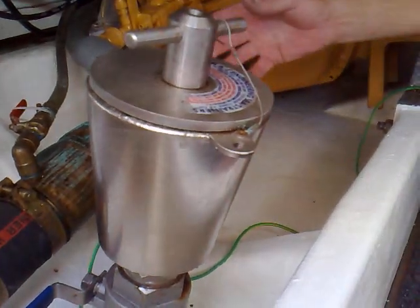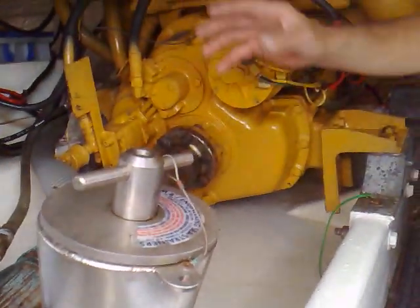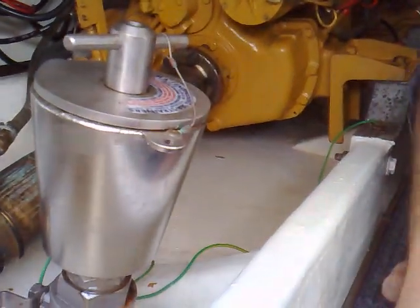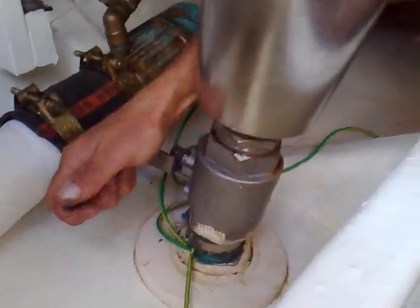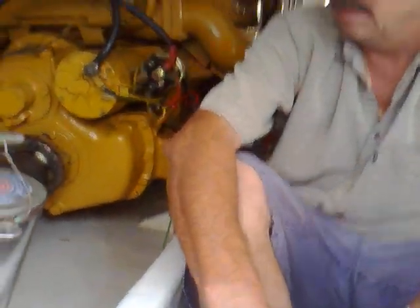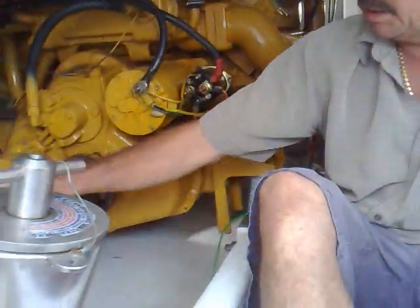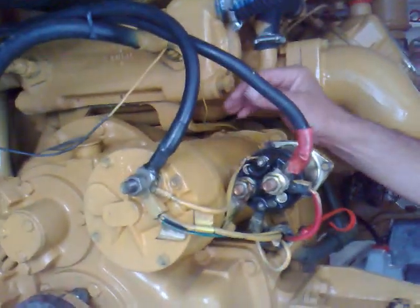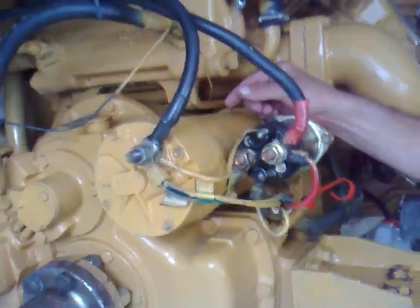This thing here is where the water comes in — that is sea water. That's why we've got this valve up here, as you can see. We'll turn that on. What that does is it allows the motor, when it's running, to be cooled through a heat exchanger with sea water.